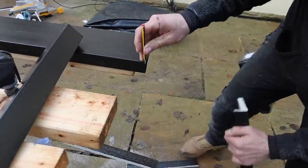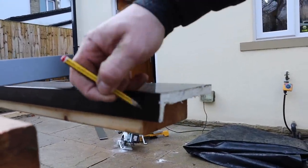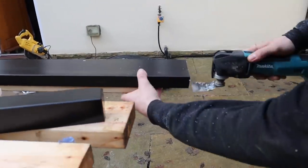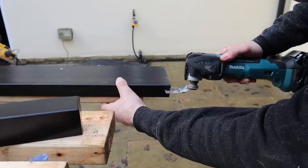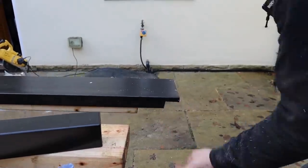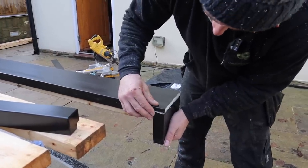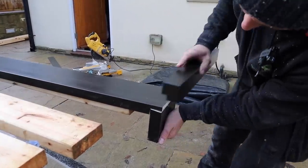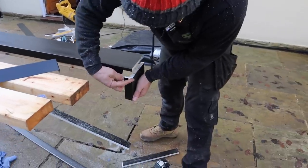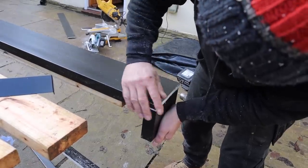You mark the distance there and that distance, then take that section out with a multi-tool or hand saw. Now imagine that's the front fascia and this is the side fascia — they now butt up nice to each other, and then the corner trim goes on there and conceals everything. You need to chop out that distance — the thickness of the fascia — and that allows the bar to get back far enough for the corner to cover the detail.